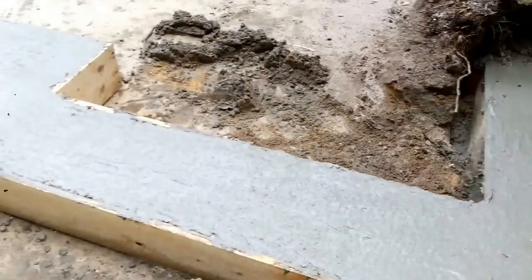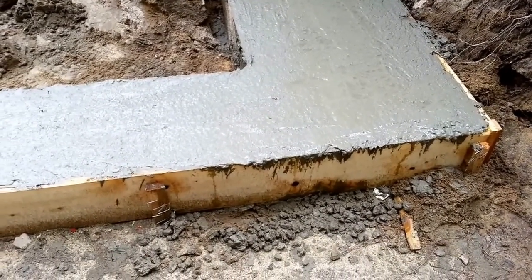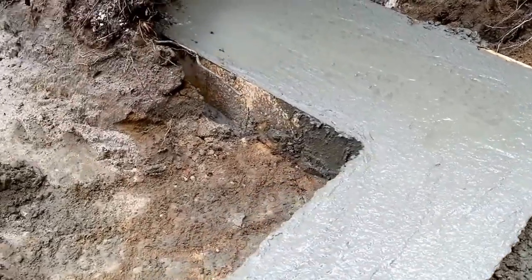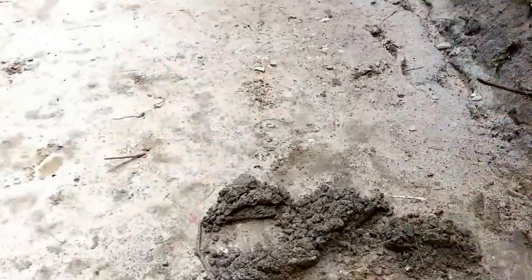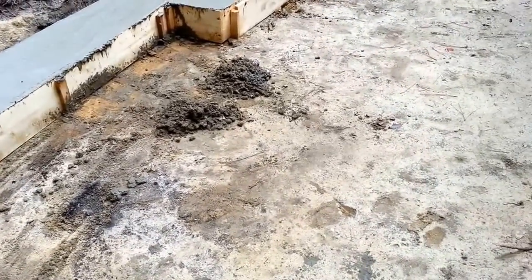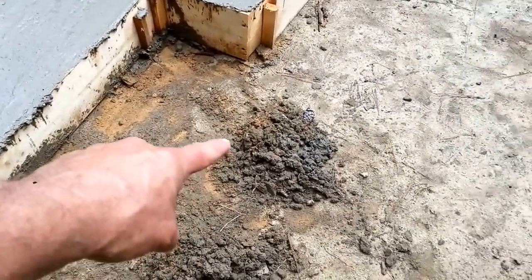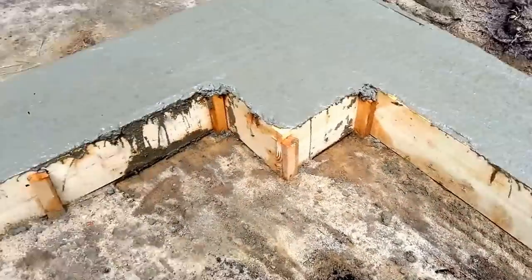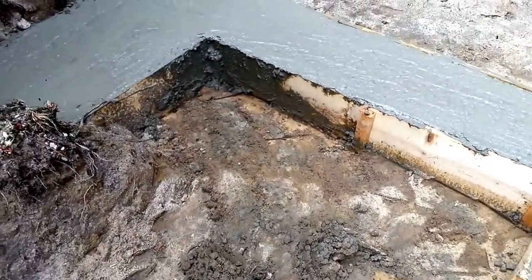We form on top of that which gives us that eight inches. Now I want you to see that I pulled away all the concrete here so that it allows me to freely pull up those form boards. Also, the homeowner wants to have a clean crawl space, which is required by code anyway, so it's better to do that now while it's wet. I kind of piled up smaller piles so it's easier to pull back and get that up.